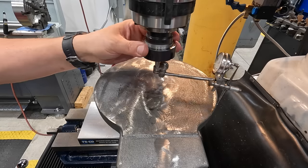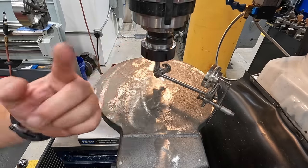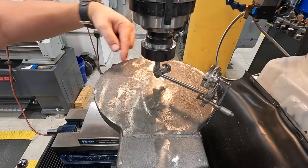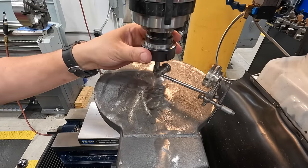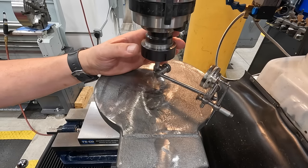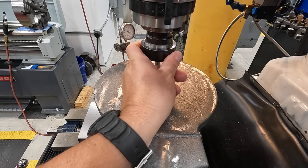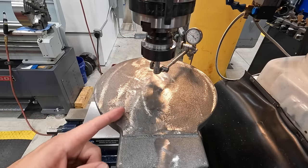I'm happy with where we're at. Starting from this point, working all the way around, that needle bounces back and forth about 10 thousandths of an inch, but what I'm doing is I'm working off 180 degrees. So right in that general area there, it's anywhere from 85 to 90 thousandths on the dial. And then if we go across here to that side, you can see that we're bouncing between the 85 and 90 mark there.